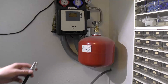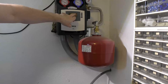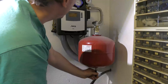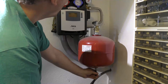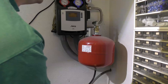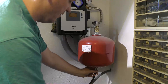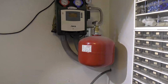While charging the compressor has started running, the temperature raised up dramatically to 72 degrees Celsius, which means there was a lot of hot water right there. So I'm going to pressurize the expansion tank. I'm not going to go all the way up to 2.5 bar because I know this system is not really leak-free, so I'll go to about one and a half bar. I'll go see if it leaks out anywhere.